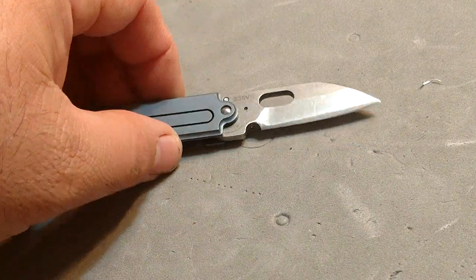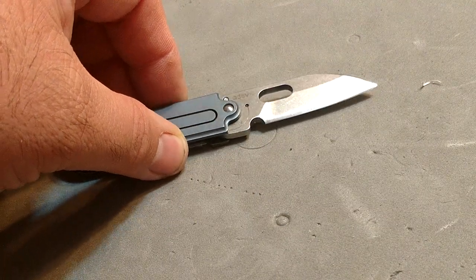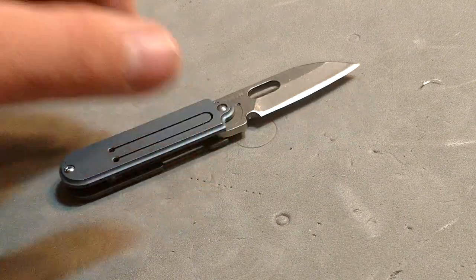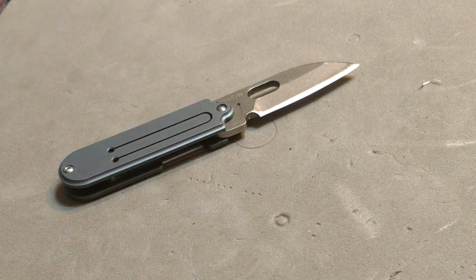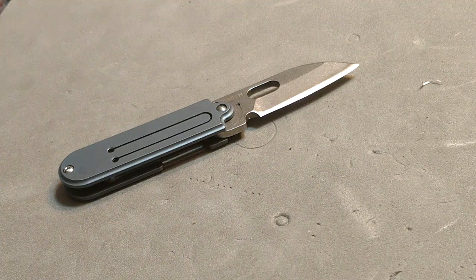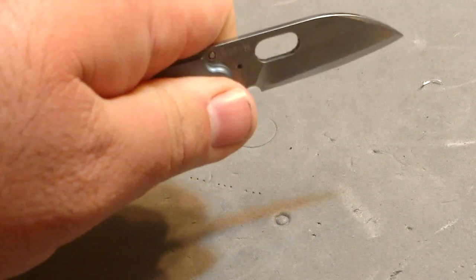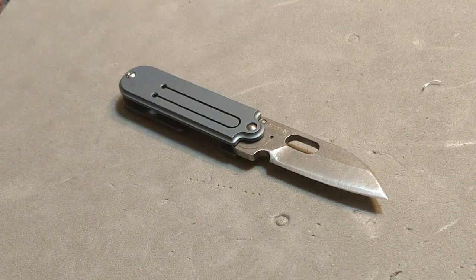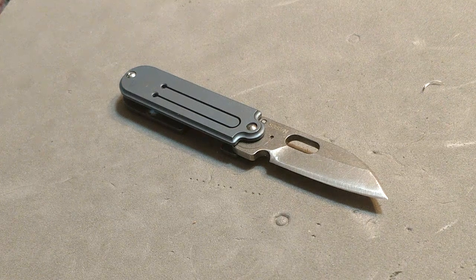After the reprofile it's a very hard steel that takes a very fine edge, which is a sign of a good steel, and it seems to hold that edge fairly well. I took the edge back to a pretty reasonable angle now. It slices through cardboard and paper a lot better — a huge improvement. For such a small knife with a wide blade, I want a nice thin slicer that you have to put no effort into.